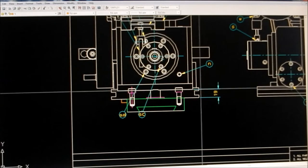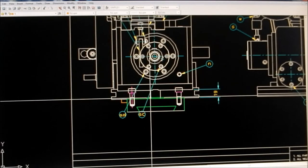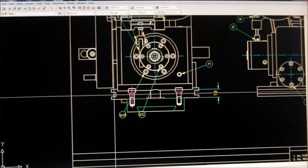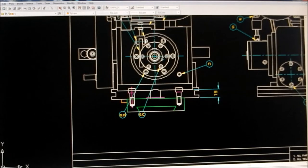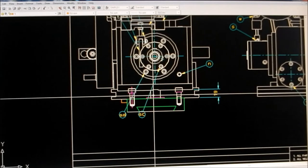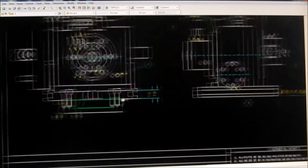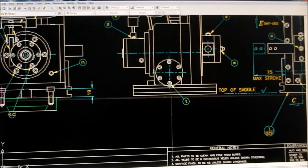You'll also notice I've machined out a slotting arrangement on each side. The reason being that I may want to mount this on the milling machine table and make up a slide arrangement with a lead screw so that I can adjust this backwards and forwards and actually do sliding off the milling table directly onto the dividing head. That's just a side view of what it looks like.